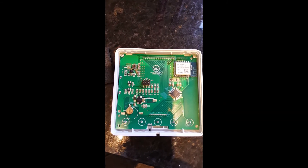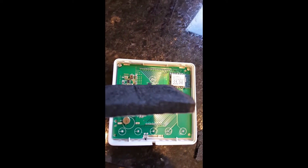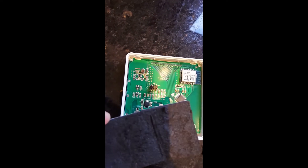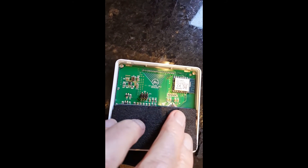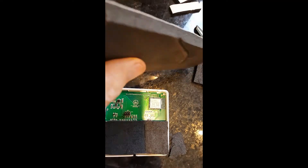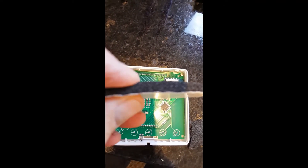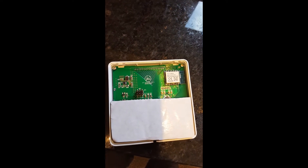The way to reduce the effect of the heat from the transformer reaching the thermistor is to put a piece of insulation material. I'm going to place the insulation just into that section there — and I've already proven this, that it actually works — so this will now prevent the heat from reaching that thermistor. It's quite easy to do; I just cut it from a length of insulation, which is basically sound or heat insulation that I had. Just trim it down if it's a little too thick with a very sharp knife. Slot it in like that, clip that back onto the base, and that should do the trick.